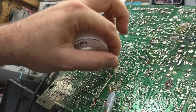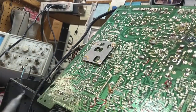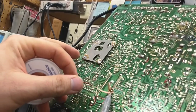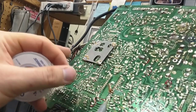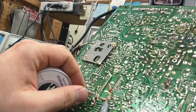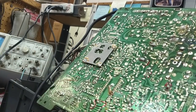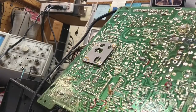When we put the new IC in you have to be very careful how we apply the heat, because if we just solder the pins linearly like I'm desoldering it, I'll very likely superheat a portion of the chip and cause a failure. It's very important to apply heat in kind of a zig-zag or opposite corner pattern. My bench isn't exactly totally stable and setting the camera on this lamp stand makes it a little shaky — I wouldn't have room next to me to set up a tripod anyway.